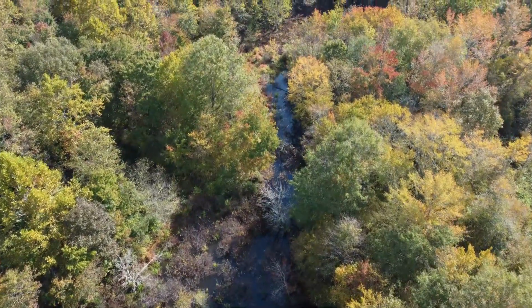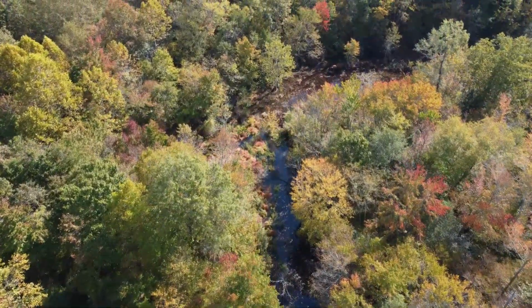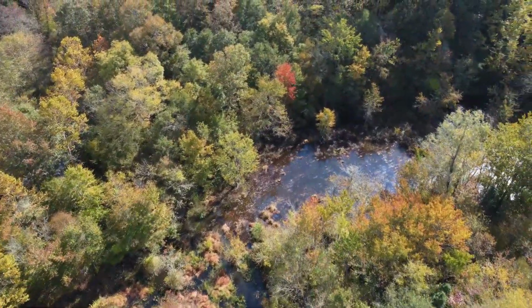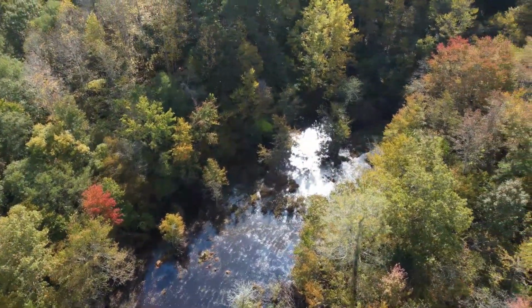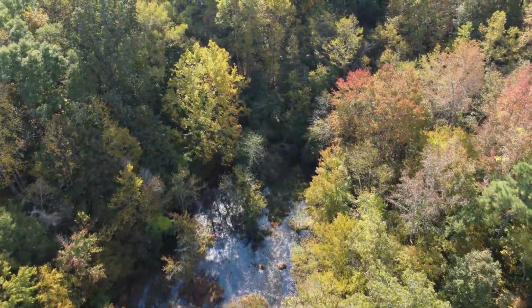And just FYI on using this 3-inch Harbor Freight trash pump, I got on Onyx Hunt, which is a great hunting app. If you've never used it before, I recommend it. And they're not a sponsor. Nobody's a sponsor except me. But I drew a polygon around what I think is what I flooded, and it's about 1.25 acres. So you can get an idea of how long it takes to put shin deep water on 1.25 acres. Some spots are deeper, but you're probably talking a good solid 12 plus hours to flood that with a 3-inch trash pump. So think of that.